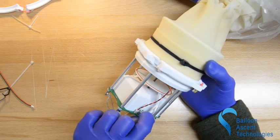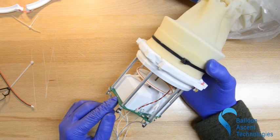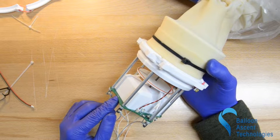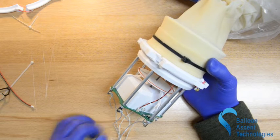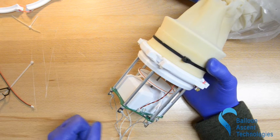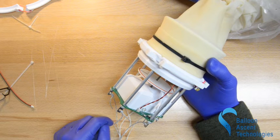So we'll turn it on, hold it for just a second or two. Its light comes on. This 2 Hz blink is indicating that it's getting the heartbeat. Once again, its supercapacitor is charged up because I've been testing with this recently. If it wasn't, it's going to sit there and rapidly blink for a while. That blinking should stop after 3 minutes or so.